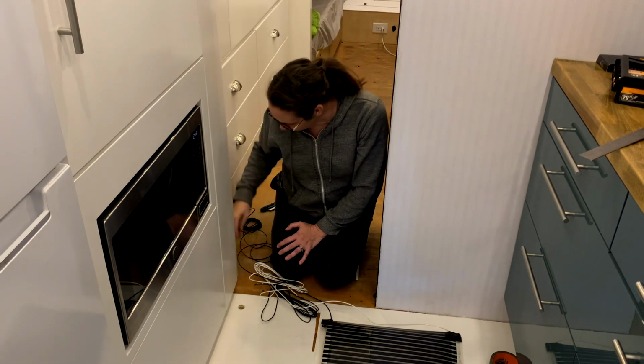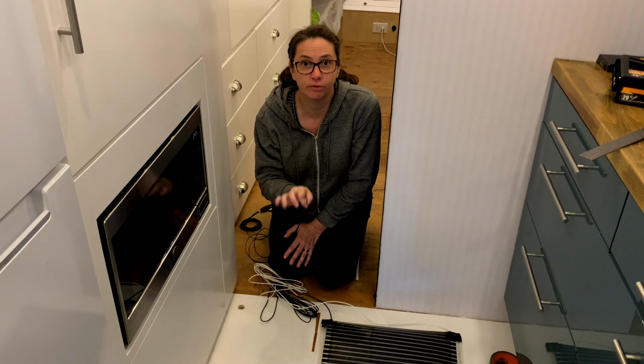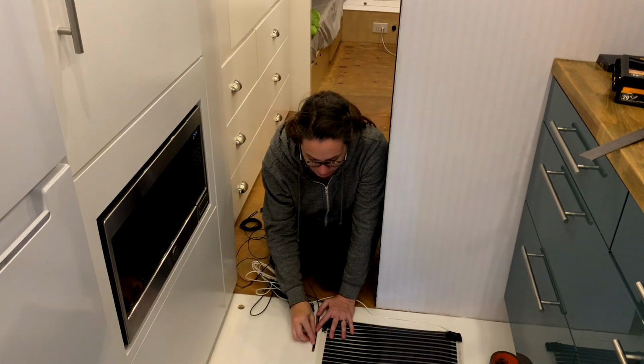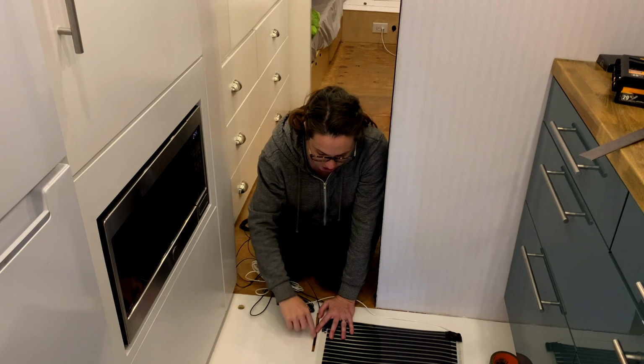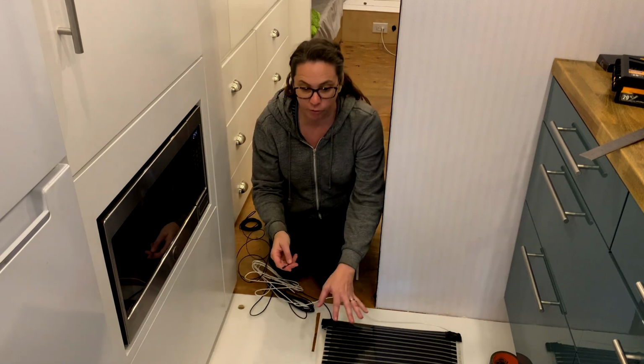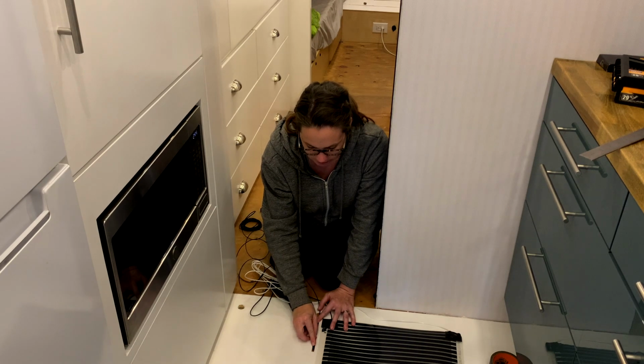And then from the thermostat is the sensor wire. So that's gonna have to go the opposite way and come down and back up. And from all the installation videos we watched installing this with floating floors, this just needs to go real close to one of the mats. And again, I've channeled out a little spot for it, but it cannot touch any of the black part of the mat. So before we tape this down, we're gonna go ahead and lay this floor sensor in here and then tape over all of this together.